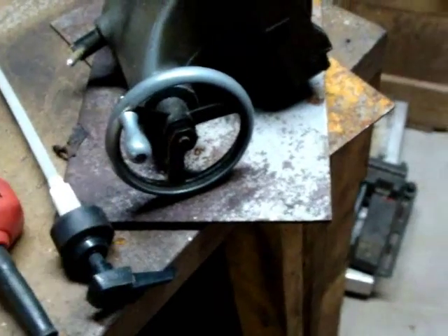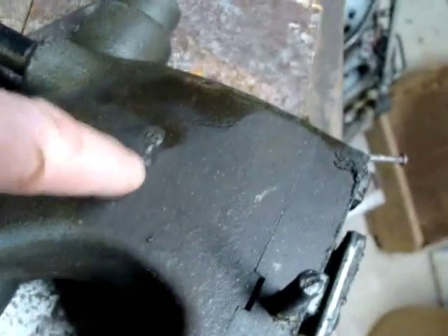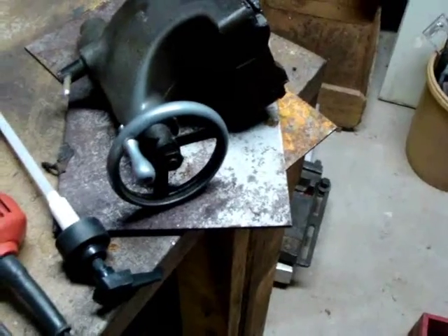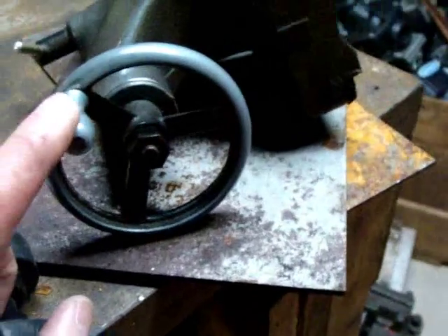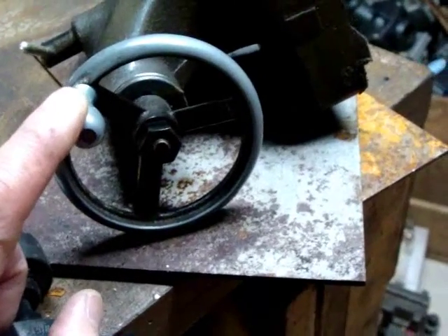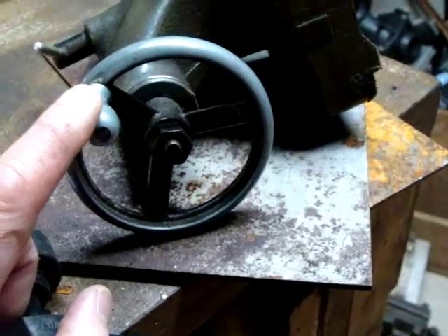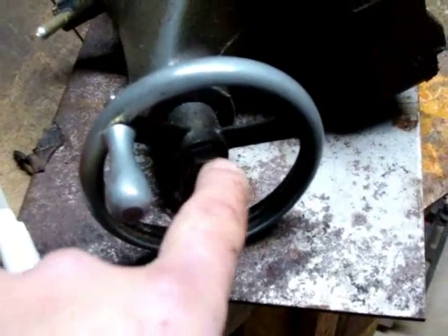Most of these handles are stamped somewhere with a part number — almost every part on this lathe is stamped with a part number, which is handy. For instance, this is stamped 9-6, that's the base part of the tail piece, and 9-5 right here is another part. Hand wheels abound on eBay, but interestingly this being one of the first lathes has an earlier version of the hand wheel. They changed the part number and the design slightly over time, and I saw two different listings for what's supposedly the same part number but with different styles.